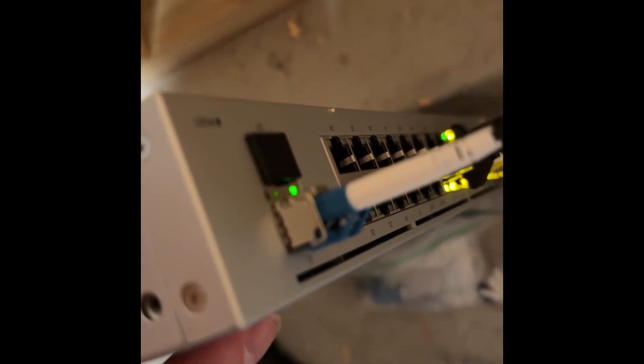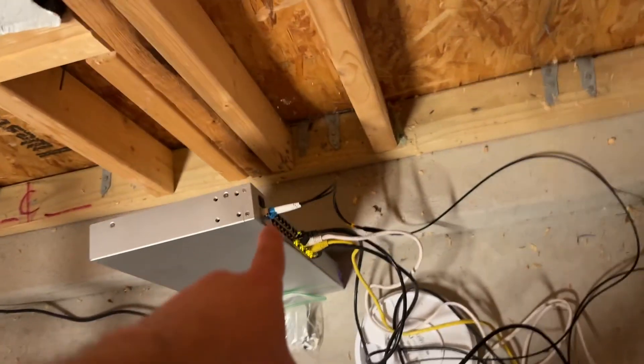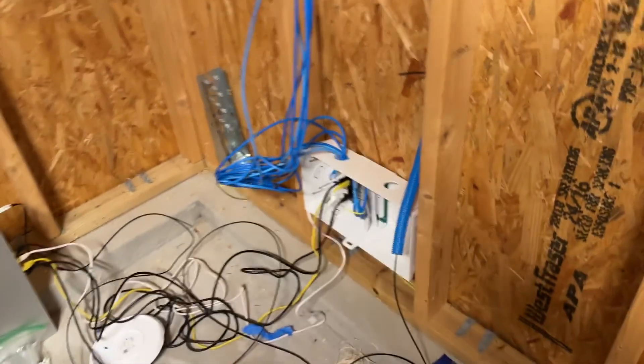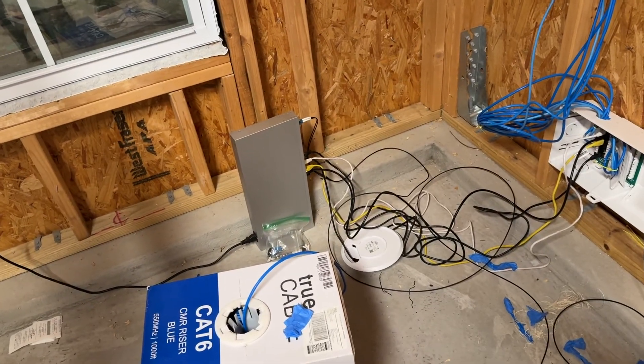The yarn snapped, so I didn't want to make another trip to get a thicker cord. I used Cat6 instead, but it only goes so far because of all the bends. So I used it in tandem with a cord to pull the ethernet through, then taped the fiber to it and pulled the fiber to the other side. Just get thicker yarn — don't panic, it took about a minute and we're good to go. There you have it — a UniFi switch that provides power and data to a bunch of security cameras as well as a WiFi access point, so I have WiFi in the garage. Stay tuned for the grand finale when everything is complete — happy fiber forever.